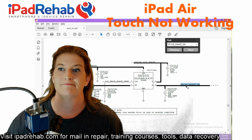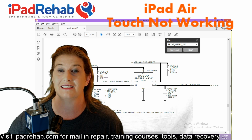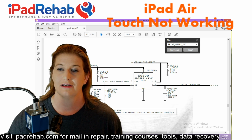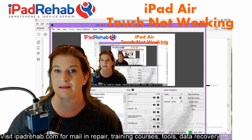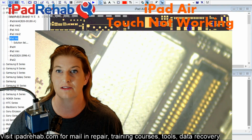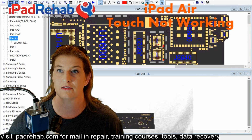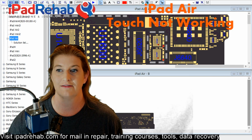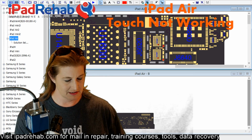So my first question would be, okay, is this rail present? So let's go check on C6510 to see if we have 1.8 volts or not. So let's go on a hunt. Where is C6510? So let's go back. Let's go to ZXW. Let's reorder this stuff. All right, so now we're looking for C6510 on ZXW. So let's see if we can find it. C6510. Man, it takes forever to stream stuff, just to do all this kind of rooting around.